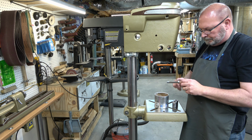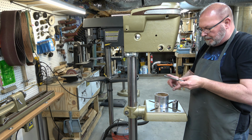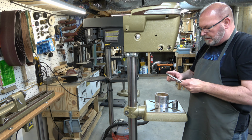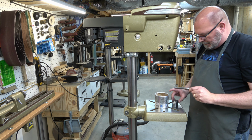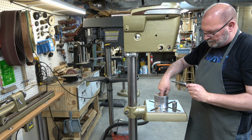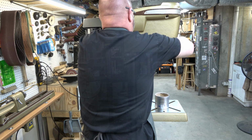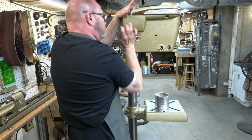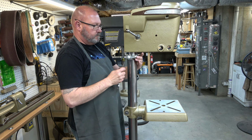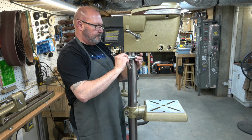And then we'll lube up the head lock. So that's the lock screw and handle. And then we've got the sleeve and then the lock nut itself. And these have flats on them, and those flats need to face towards the column. Once we've got everything in there, we can lock it down. And then we can go ahead and remove that column collar because that was just temporarily there.